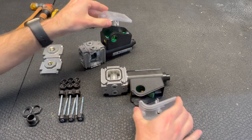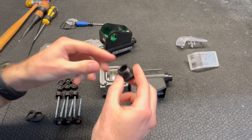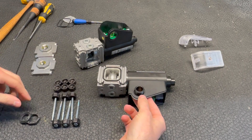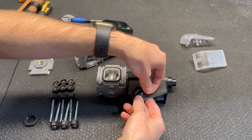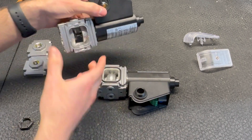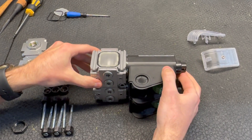You'll need to remove these covers here and take your cable gland and feed it through the bottom valve. Use your grommet to hold this in place and seal the gap between them, and try to line these up as you put them together so you don't move the gaskets you just put in there.